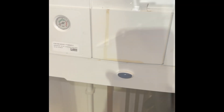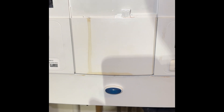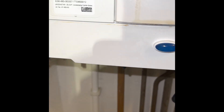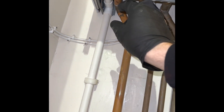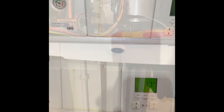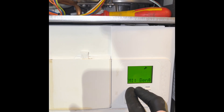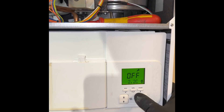Let me show you what the difference now is with the flow compared to what it was before when I run the hot water. So I'm now just filling it up — I've just done the main heat exchanger and the plate heat exchanger. I'm going to press these two buttons, eco and info, go up to menu two, select air purge mode, and turn it on.